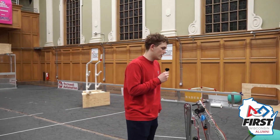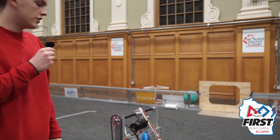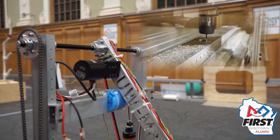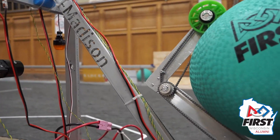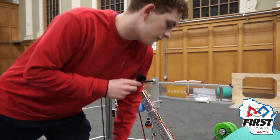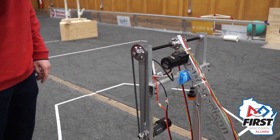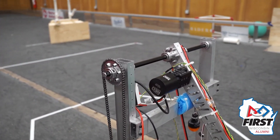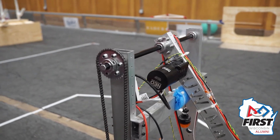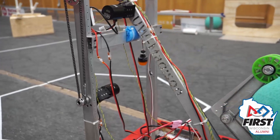Here we have our arm. We used a CNC router with a one-eighth inch drill bit for most of the holes and the adaptive clears for the motor mount, the hex shaft mount, and then the wrist mount. This was beneficial to make sure that we were a little more accurate and to speed up the assembly of the robot. This could also be done with just a traditional drill bit or a step bit if that is easier, more convenient, or if you don't have a CNC router.